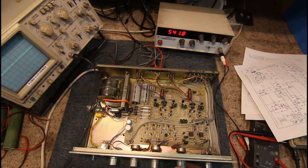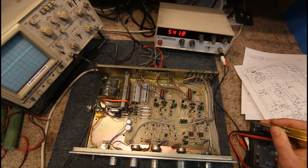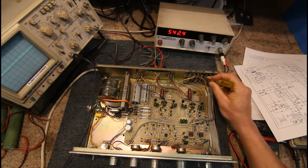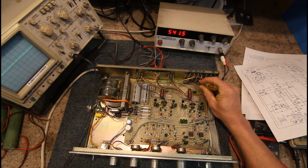There is a little bit of scratchiness — some of the other pots being an old amp. Turning it right up, I can hear a bit of hiss — that's just the background noise of the amplifier, especially since the inputs aren't grounded. That's another test, just to see if you've got that background hiss. The simplest input test is to use a screwdriver and put a bit of hum in there on the RCA sockets — both channels are there.